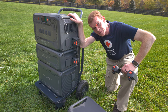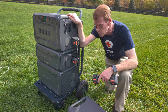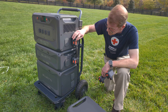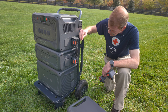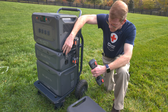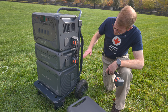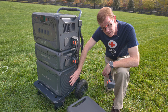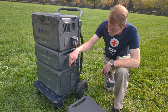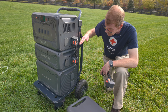One last mock-up — I wanted to get a good closeup of this. This is a configuration that will not work: Apex, a single B300K, and then B500K. The Apex has the single connector here and it has to go straight down with these short jumpers. The B300K's matching connector is here, and there's nowhere to mate it to. So if you're going to do a single B300K and a B500K, the B500K has to be at the bottom, or you need two B300Ks to put the connector back to the proper side, or the B500K has to be first.